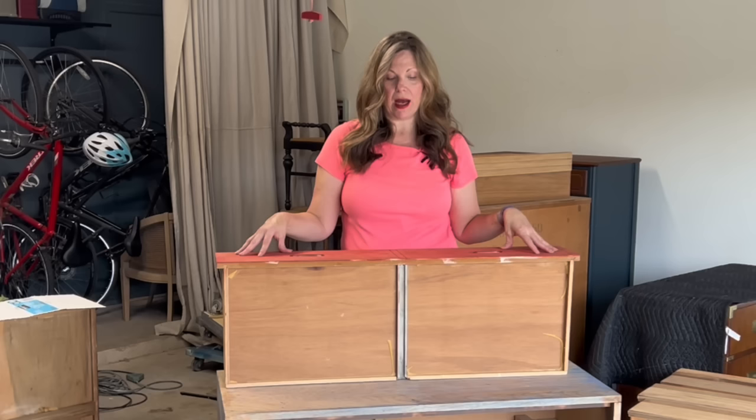So I was like, okay, what is going on underneath here? What I noticed was my new replacement was too far up. It was too close to the front of the drawer, and so I needed to cut it back. So I'm measuring the lip there on the drawer, and I'm just going to cut off some of that center drawer guide.